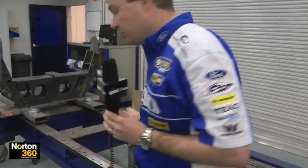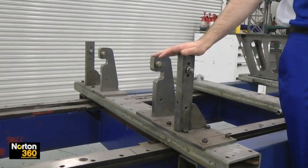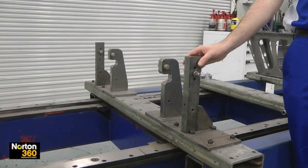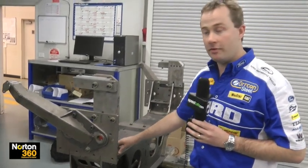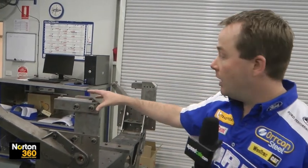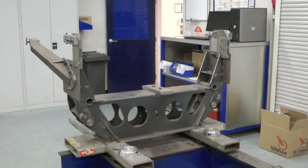This structure here is to pick up the rear rails for the rear trailing arm points — that is ground zero for the V8 Supercar. The rear trailing arm boxes determine a lot of the measurements referenced in the regulations, so these points are very critical to get right. We bolt the car down in the rear through there, and then if we move to the front, we bolt it down through this structure here — four points that pick up the base of the rail, specified points by V8 Supercars. And then this structure here helps us build up what we call the shotgun panel and the damper pickup points, with other jigs and fixtures that secure to this to make additional points. It's quite a substantial structure.